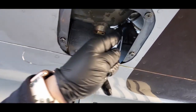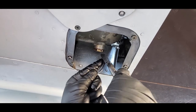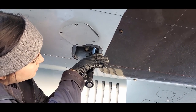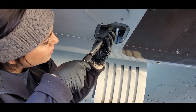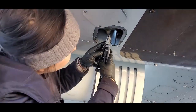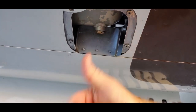So the safety wire is secured on a tab on the back of the oil drain neck right back here. It's on the back side of that. So start by safety wiring it back there first and then grab the plug. Righty tighty, right rule of thumb, just like that. Right. Job done. Looks good, pulling the nut tight.